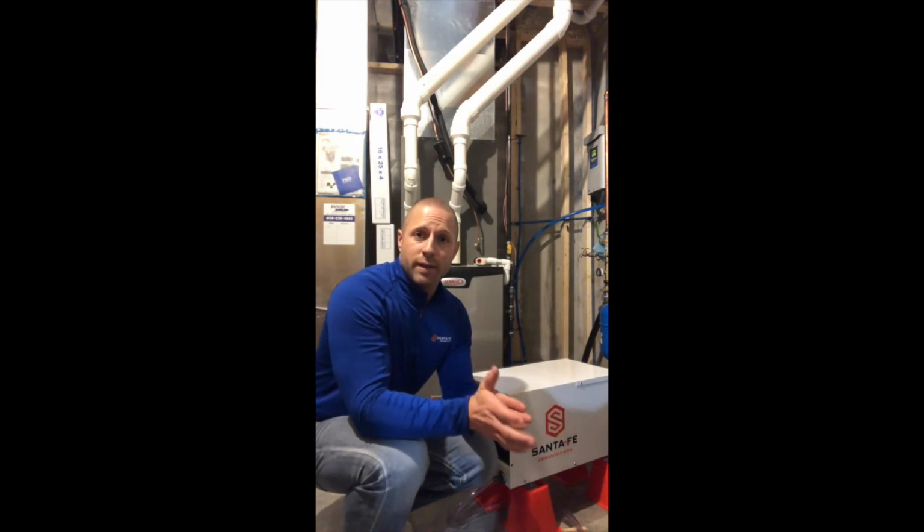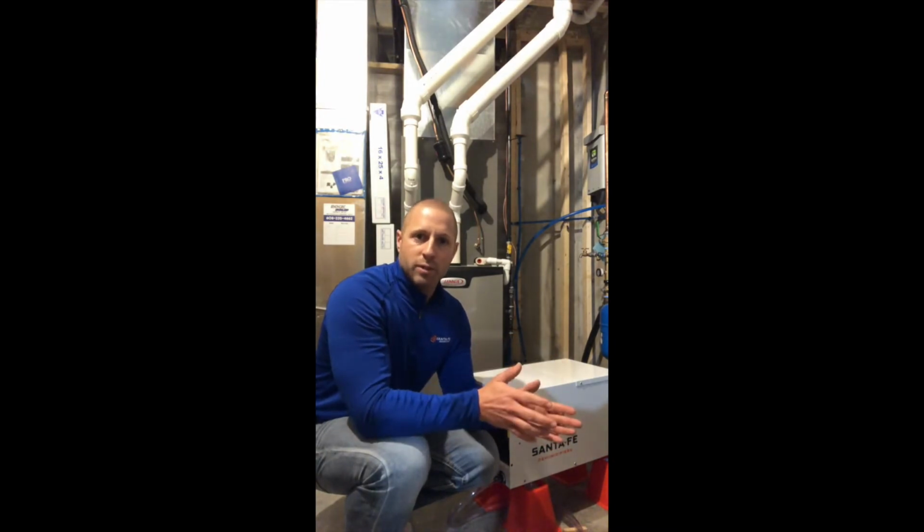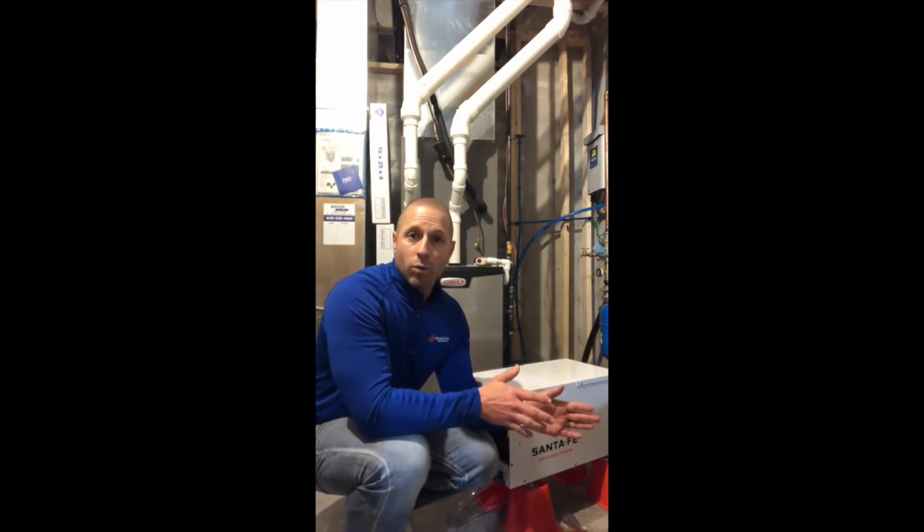So long and short of it, the simple answer is Santa Fe is going to be more your basic freestanding, simple plug and play, easy application. So basement, crawl space, maybe a garage, a storage area, just a wide open space where you're going to plug it in, set up your drain line, and let it go to work. There's no ductwork or anything attached to it.